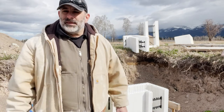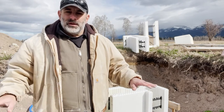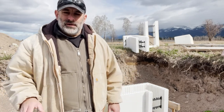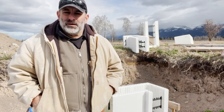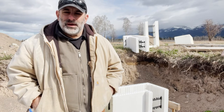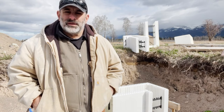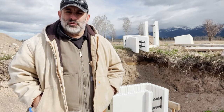Luckily here I've got quite a bit of flat plane. Everything is open and so I can work with it. Now I just have to set all the corners, make sure that we've got square along the house and that everything is evened up, and then we'll start laying down the first row blocks. The first row is pretty much the essential row.